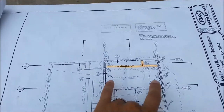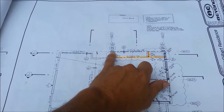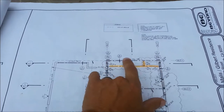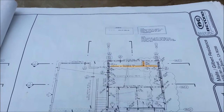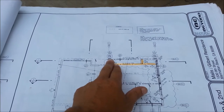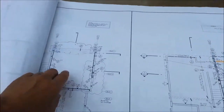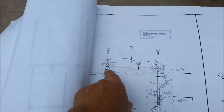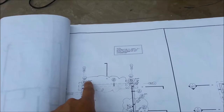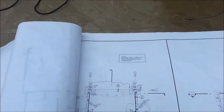What we do is we put what's called a hardy frame. It's a steel frame that we put into a foundation on both sides and put a beam all the way across. This frame is so rigid and strong that combined with this beam on top and a grade beam on bottom — that's our foundation — we have a big concrete pad here with a steel frame, and between them is a grade beam.